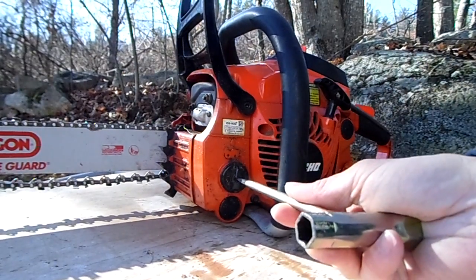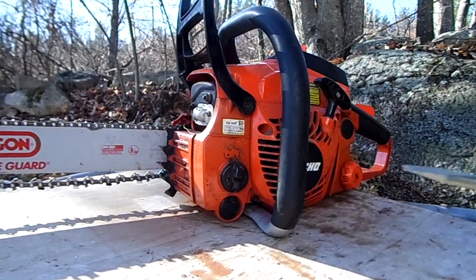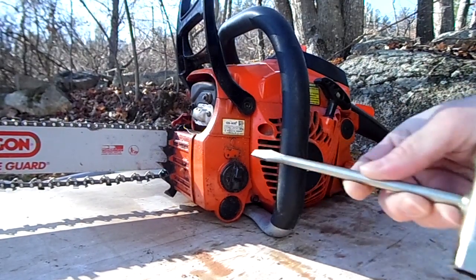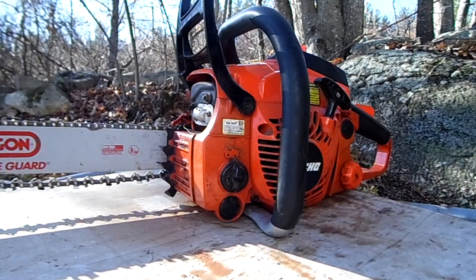You turn it and it stops. There's a solid stop in there. But it feels like you have to, that's over-tightening it. When you go to loosen it, these two ears on the cap, you can see them flexing, and after a year or two or three, that cap finally broke on me one day. It snapped right in half.